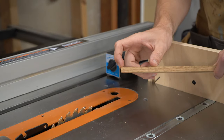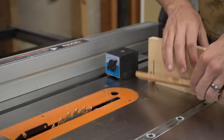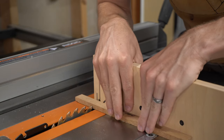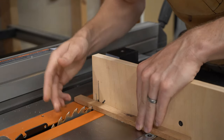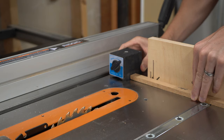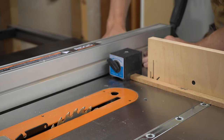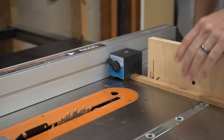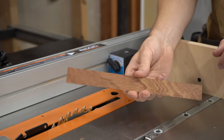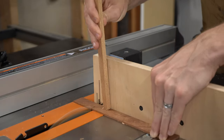It's time to cut the little stop blocks that allow you to get different angles on the jig. Each one is going to be two and one eighth of an inch long and we need five of them. To get five that are exactly the same size, I place a magnet stop against my workpiece, slide it back, lock it down, and put the table saw fence against it — now I can get extremely repeatable cuts. I also cut a two and one eighth inch piece from the micro bevel wood to match the stop block size.